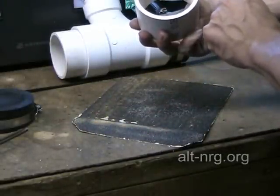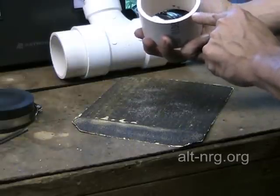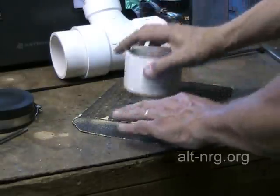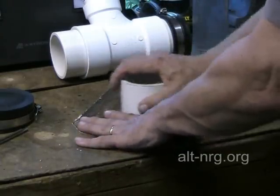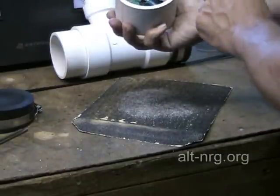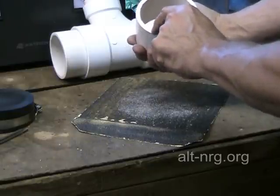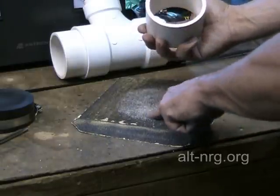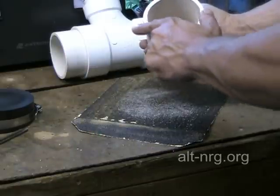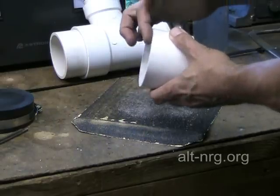What I'm looking for is a sand hatch pattern on the edge of the PVC pipe so that I know I've gotten all the way down. I notice there's a few spots where I'm not getting this pattern, so I still need to keep going. Now I can see the hatch pattern with the coarse sandpaper on the edge of the 3-inch pipe all the way around, so I know I have a fairly even surface all the way around.